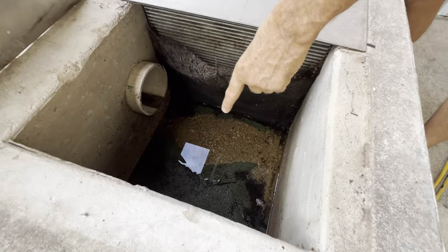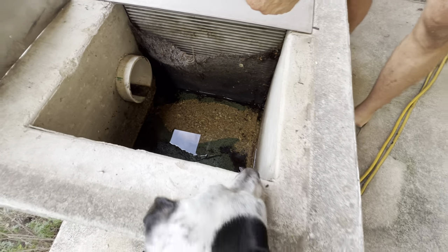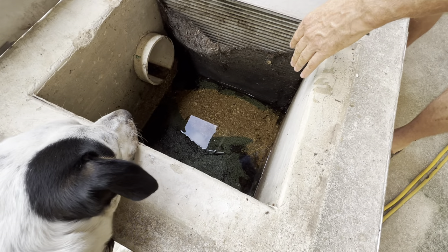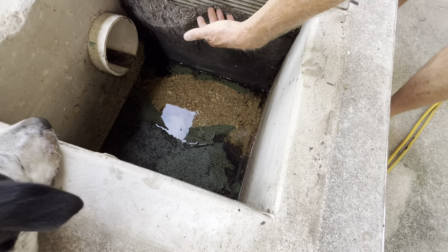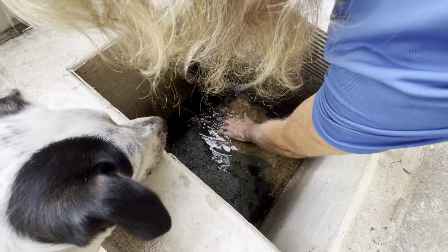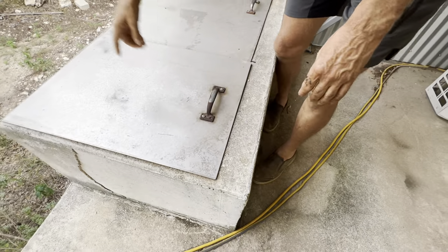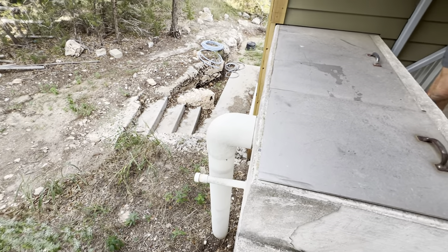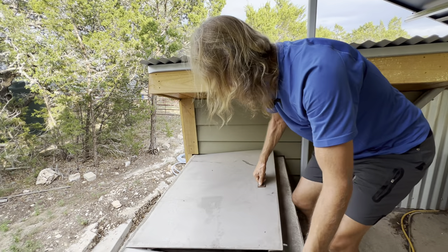So you see the granular stuff off the roof — a lot of that gets caught in that T; it doesn't rush past the T. The biggest water comes through here and goes through this mat. If this gets dirty, it comes over here. There is a drain right here with a hole, and I can open the cap off of that pipe right there and it will drain that gravel out — I can rinse this tank out. The water that goes through that first screen then goes through these screens.